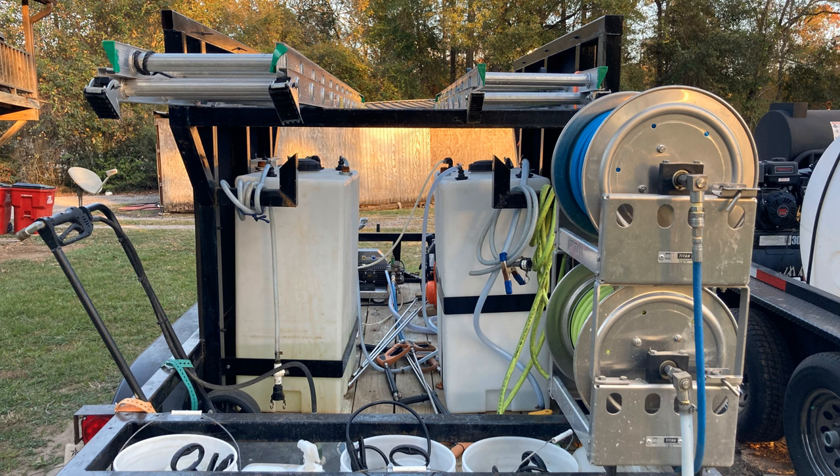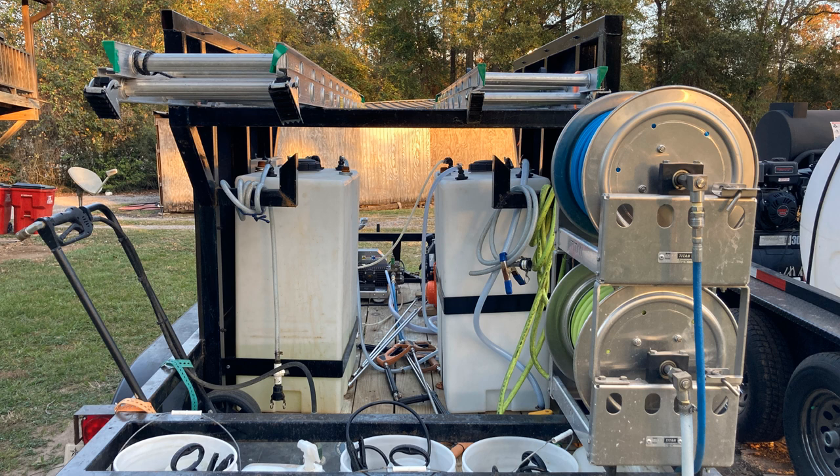When those gases and fumes start coming out of the top of that tank, that's what attacks your trailer and causes a lot of rust — not only on the trailer, but your equipment and pretty much everything. So always make sure you've got your bleach tank vented, and set it up so you don't have to open the tank. Ours fills from outside through a drop tube that goes all the way to the bottom so there's no suds overflowing. We've got a spot there for our surface cleaner — 24-inch Little Big Guy — and a rack behind it that can hold five-gallon buckets, X-Jet buckets, and pump sprayers as needed.